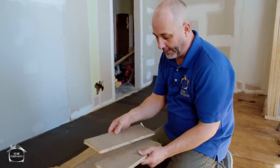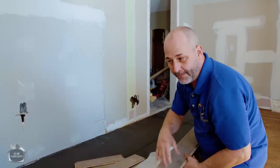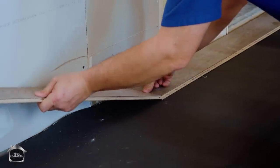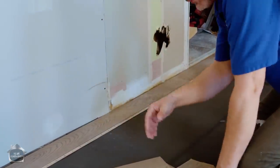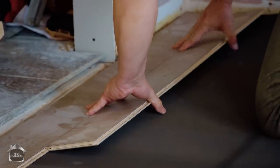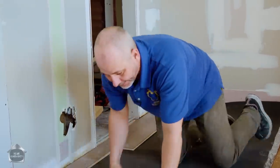This hardwood comes in various sizes — the better the supplier, the longer the pieces. I like to start the first row with the longest pieces to help keep it straight. The first piece goes down — it's a click-lock so you set it flush and drop it. We're going to put together about three rows and then position them according to the laser level line to make sure everything is perfect.